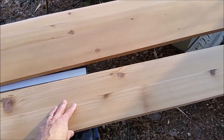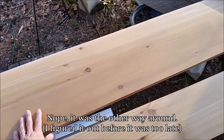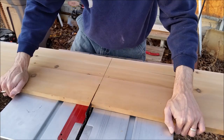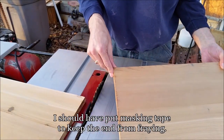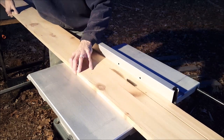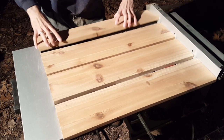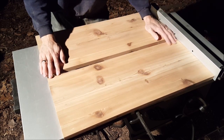All right, I think I figured it out — the skinnier board has to be cut and stacked a couple more times. And I think these are going to be the sides and they're fine as they are. The masking tape keeps it from slipping. Now that these are cut to size, I can match them however I want, glue them together and I'll have the sides for the cabinet.